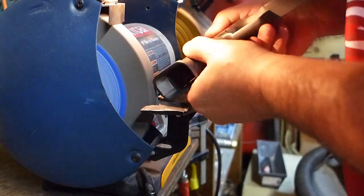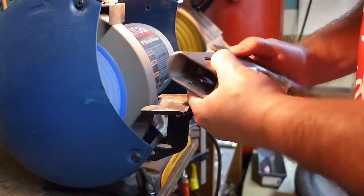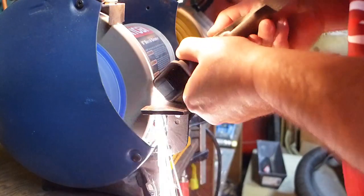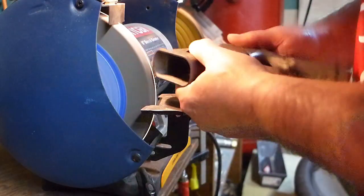I'm actually taking off some from the frame too, just so I can blend it all — not taking it off just from the bottom of the mainspring housing, but blending the two sides of the frame and the middle mainspring housing all together.